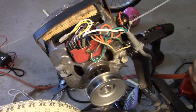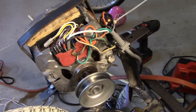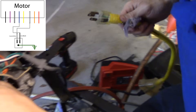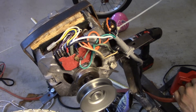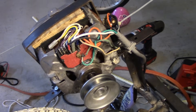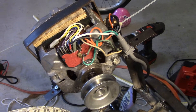Plug it in and the motor starts right up. You can also run these without the starter capacitor — if you unplug the gray wire and just leave house white to white and house black to blue, then plug it in, nothing happens. But if you give the shaft a spin, it'll catch right up. The capacitor just skips that manual-start step, which is important if the motor is attached to something.